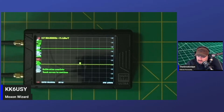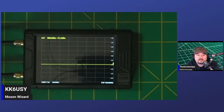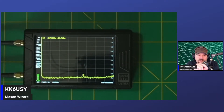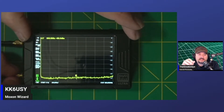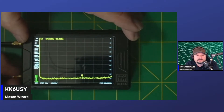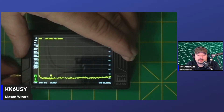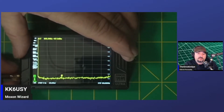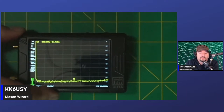Now it says it's done — just touch the screen and we should be good to go. The text in the top-left corner that was red will now go white, indicating calibration is complete. Now take your radio and disconnect the attenuator from the top port — we want to connect the cable to the bottom RF port. With the first-generation TinySA, depending on frequency you'd put the cable in different ports, but the Ultra is much nicer than the original.